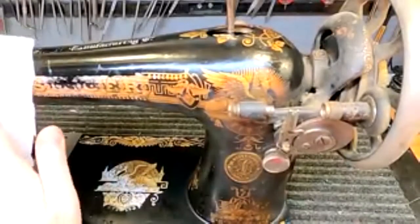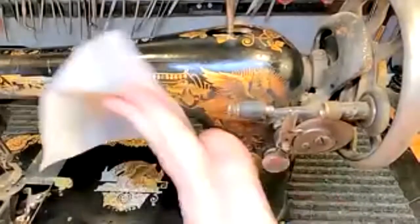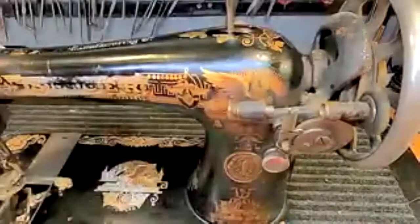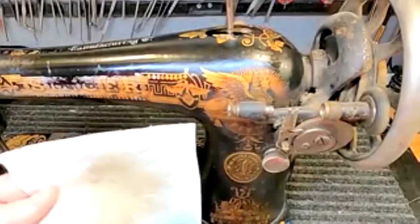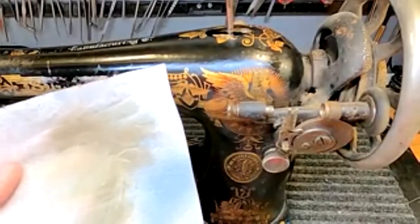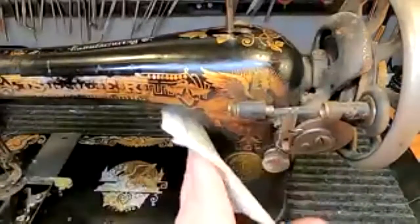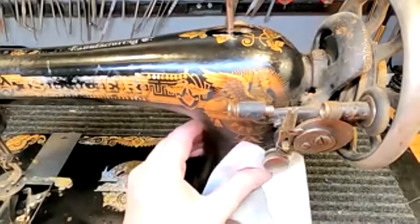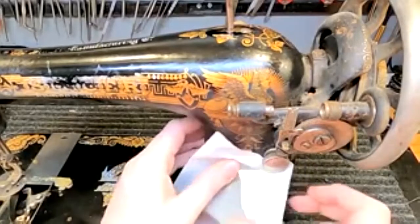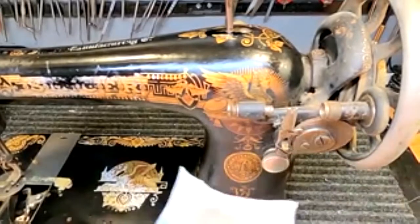Blue Creeper is going to leave a thin coat on there to protect it — especially if it's a machine you're just cleaning now and not going to get back to later, it's going to protect the clear coat from dust or dirt or anything else that lands on it. You can do this all the way around your machine; this is applicable on every single vintage and antique machine you can think of. Again, you're going to find suggestions for other things on the Internet, but if you want a proven system that works flawlessly every time, this is the one. You can use it on metal, on the badges — you can do the same thing with sewing machine oil.